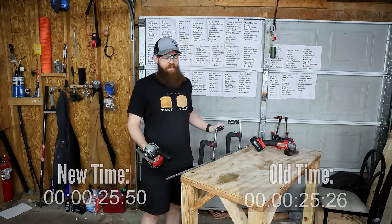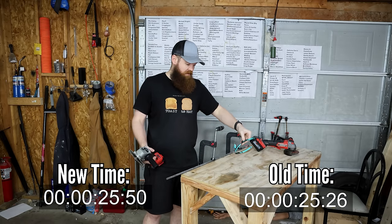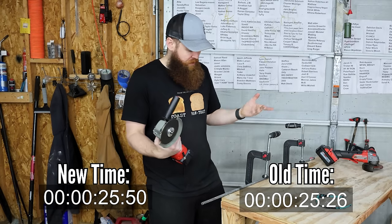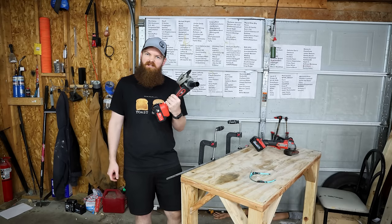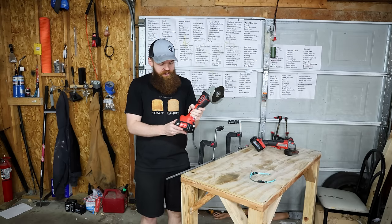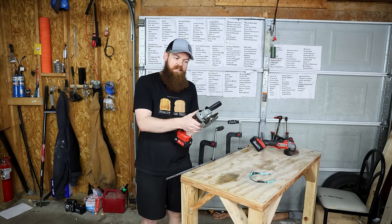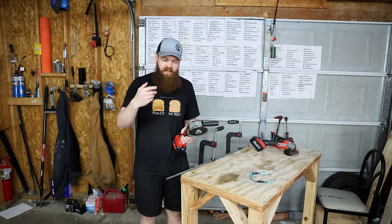We'll call that. I feel like that was probably right around the exact same time, if not a little bit longer, because of so many restarts. Jeez, that's so annoying. Can you imagine every single time you try to grind something or cut something, you're gonna stall the grinder every 2 seconds, and then every 2 seconds you gotta pull the battery out, put it back in, hit it once to wake it up, and then put it in high power mode, and then go again just to stall 2 seconds later.